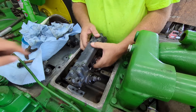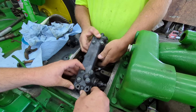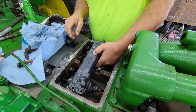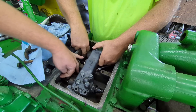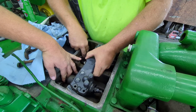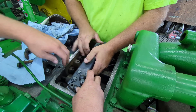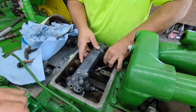We've got new gaskets, new O-rings, and there's that little tube that sticks up — you just got to kind of fish them back in. You do have the rod that sticks out, and you also have to get these positioned where they actually push on the camshaft, because these pumps are camshaft-driven with a push rod. A lot of stuff to line up all at once.